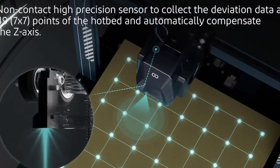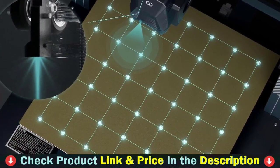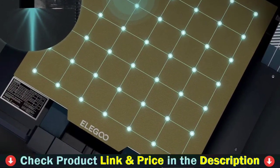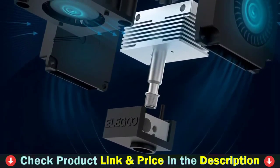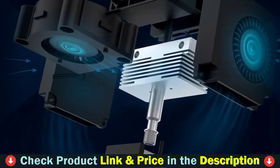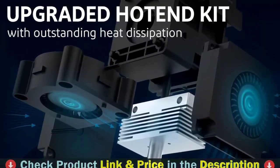A magnetic platform with special coating and spring steel sheet provides good adhesion and anti-warping — just gently bend the print steel plate to release or pop off the prints. The 420-watt high-power hotbed can quickly heat up to 100 degrees Celsius. This upgraded auto-leveling function features 25-point smart and precise calibration, compensating for heated bed unevenness automatically. Leveling and printing can be completed with one button for simple operation and a greater printing experience.